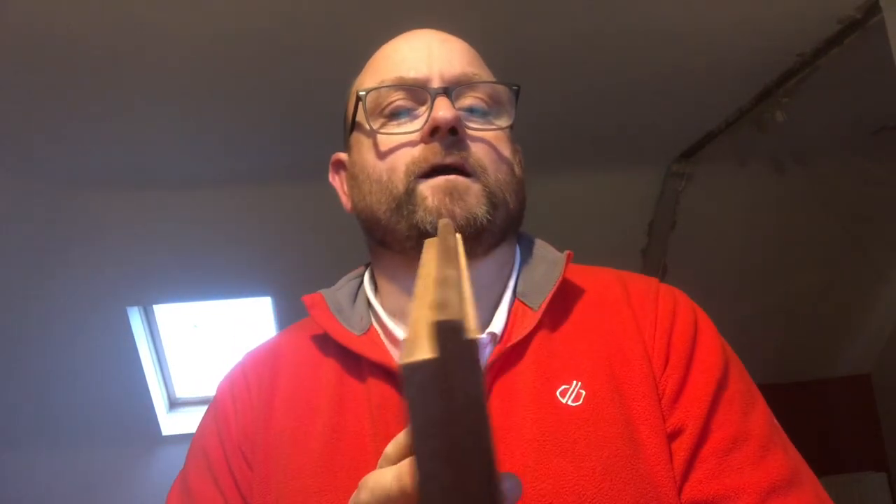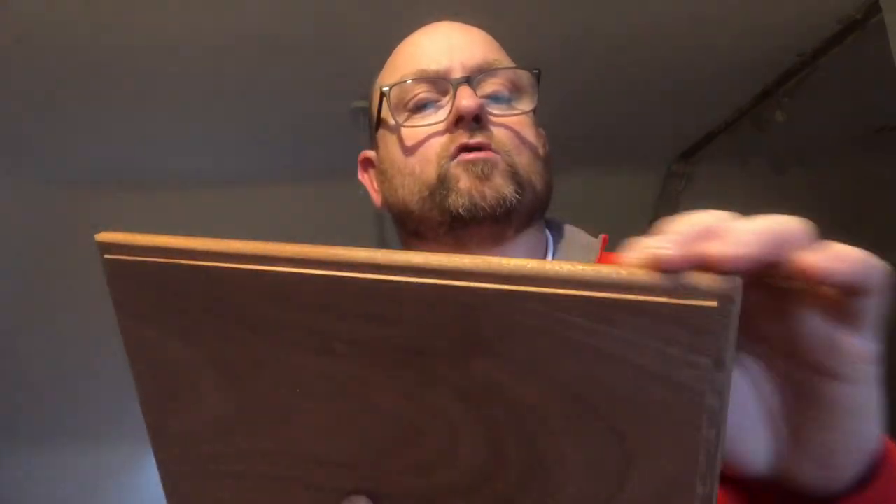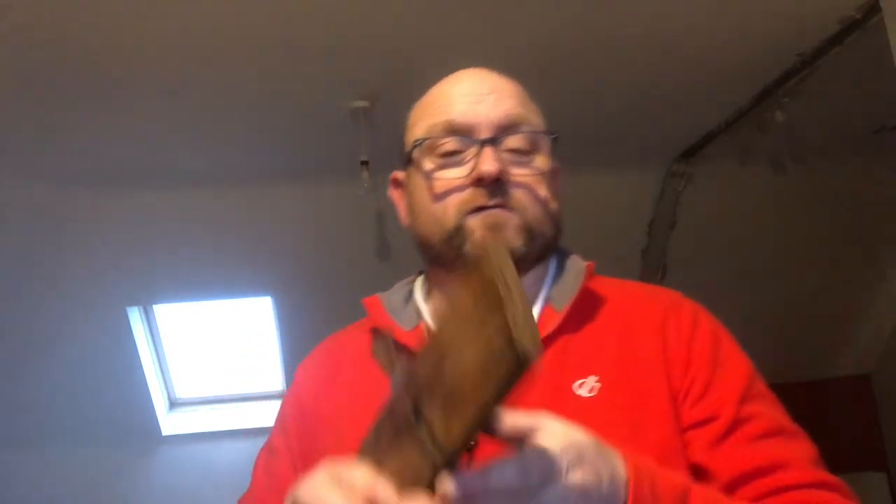Before I start I'm going to show you what I've done. You can see we have a lovely round on that, all done with a hand plane. The plane of choice is a number four, and it's a skew hollow. The blade is five sixteenths of an inch — that's how it was sold to me — so nine millimeters or thereabouts is what the round is.